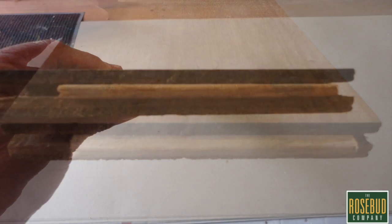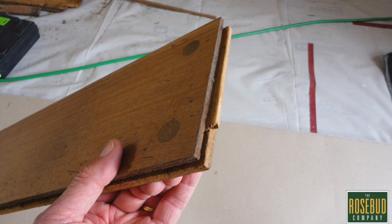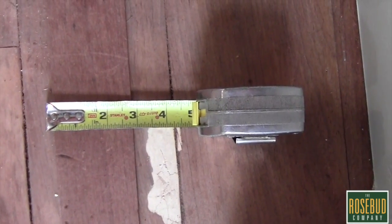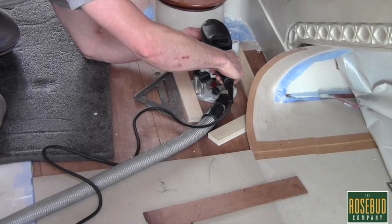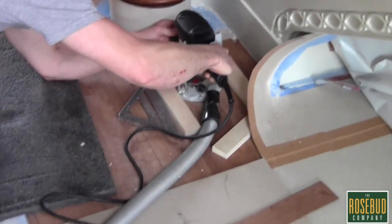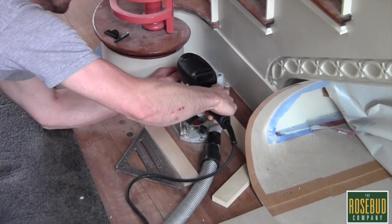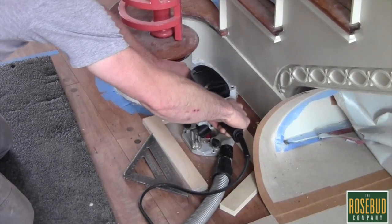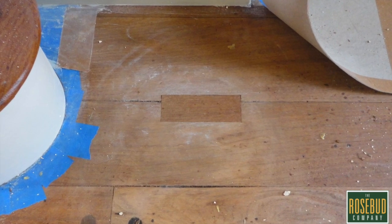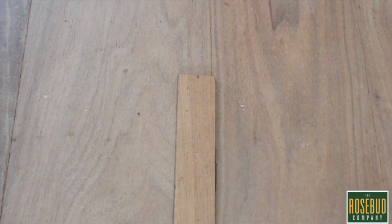This is an end shot — that's a chestnut spline there. Very nice, easy extraction. In other areas we decided we were going to use the Dutchman to take care of that damage, and Peter took his router — again a very clean operation — creating a cavity going down about three-eighths of an inch in depth. He then cleaned it up with a wood chisel, and that allowed him to put the Dutchman in place. Very nice installation. Every place that he did this, we ended up with some very, very nice repair work.